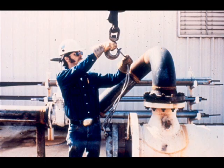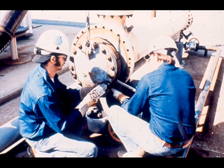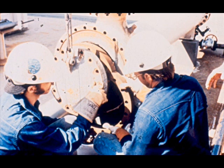Now the floating head cover is exposed. Hook your lifting cable to the floating head. In some cases, an eye will be welded to the cover for securing the cable. On other covers, an eye bolt must be screwed into the top of the cover flange. Remove the floating head bolts. Remember that the cable only secures the floating head and the split ring backing device will be loose and free to move when the bolts are taken out. Don't let it fall on you or pinch your hand. Remove the split ring parts to a safe out-of-the-way place.